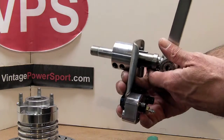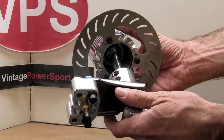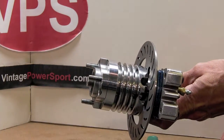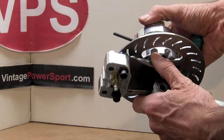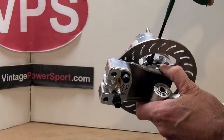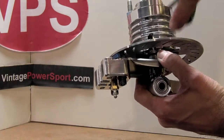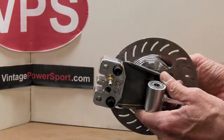The hub goes on this way. You can see the clamp fits inside, which makes this all very compact on the stock stub axle on the spindle, so we don't have to go to a very long spindle and a wider track width than is normally used on this period of cart, which is actually from about 1974. These clamp screws you can access right here through the hub, and you can tighten up the clamping bracket on the spindle to fix the caliper position.